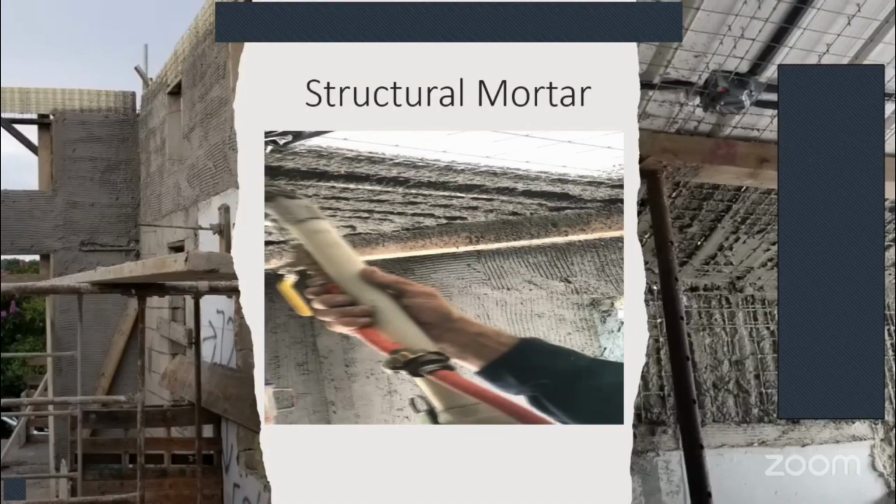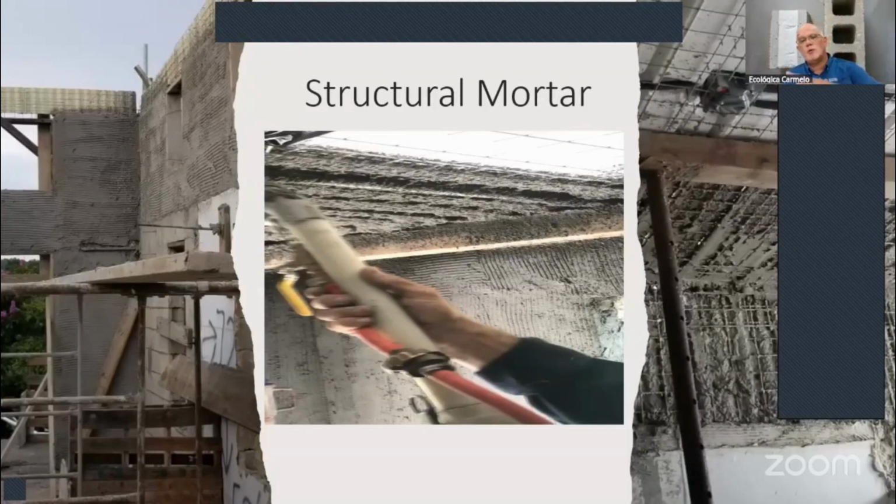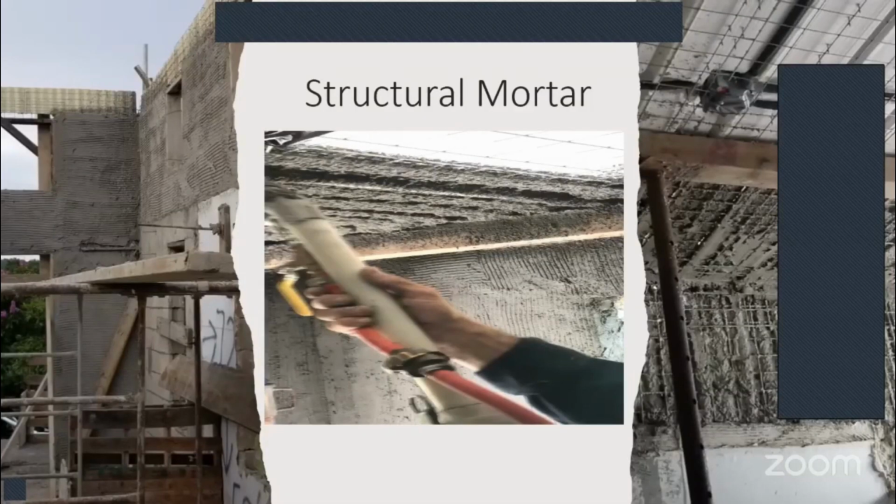Well, the concrete acts like a sponge, so the water's going to stay there. For the roof, if you have a flat roof or a sloped roof and it's concrete, then we recommend you seal it with silicone or whatever waterproofing method you want. On the walls, you'll probably use a synthetic paint over that. But you don't have an additive in the concrete that will help with waterproofing the concrete itself? No, not for this product.